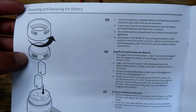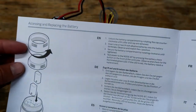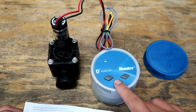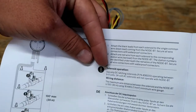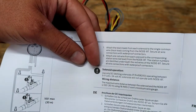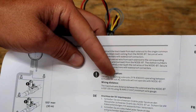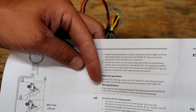Accessing and replacing the battery — as we assumed, we've got two 9-volt batteries in there. Test the power node by pressing the battery check button on the front of the controller and observe for an illuminated green light. If the LED is red, the battery needs to be replaced. Connecting DC latching solenoids — we can only use DC latching solenoids. 24-volt AC solenoids will not operate. There's also a wiring maximum distance of 100 feet.